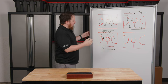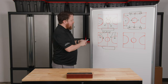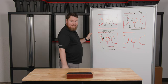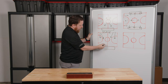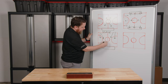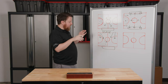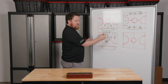The idea is: if we can keep our speakers in the same general location, it focuses the listeners' attention back toward the stage, and the sound waves all arrive at basically the same time. If we were to put a speaker at opposite ends, one speaker's sound arrives much sooner than the other's, making things really unintelligible and difficult to hear — something we definitely want to avoid. So we do this clustered option, not the split option.